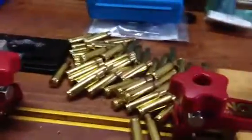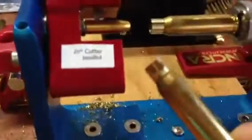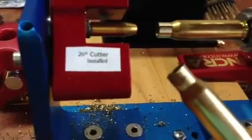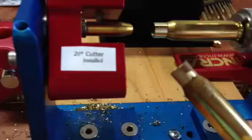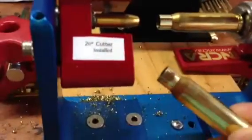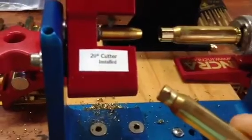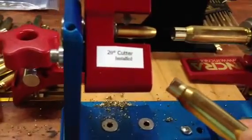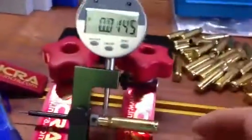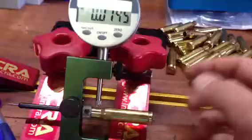So I'll cut over to a piece of brass that's already been done. What you see here is a dark area where it hasn't been touched, and only the highlighted areas where I've actually skimmed a little off. The idea is I don't want to take too much off because I don't have a super custom chamber or anything — all I'm trying to do is get consistent material so that I get nice, consistent releases with the neck tension.